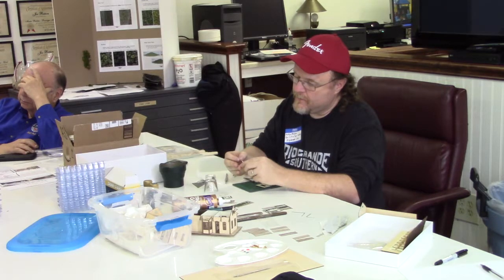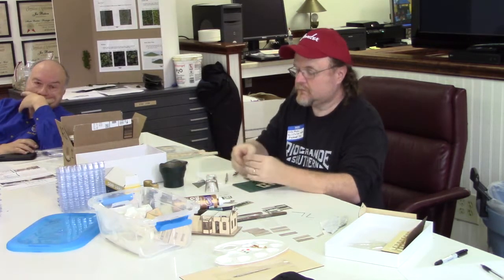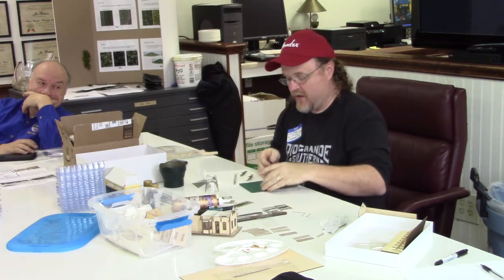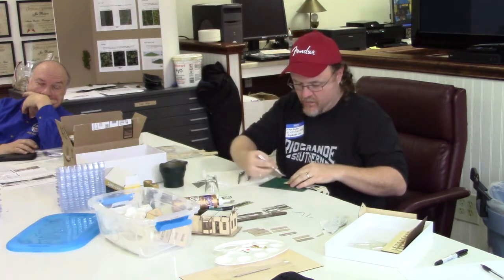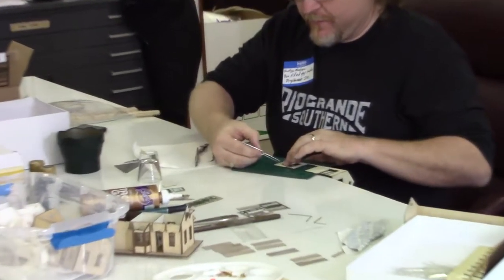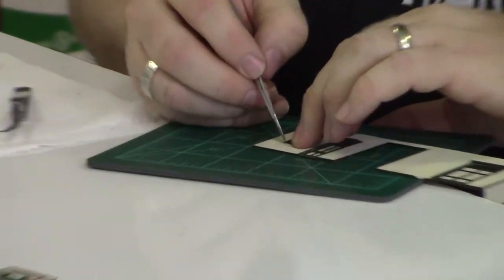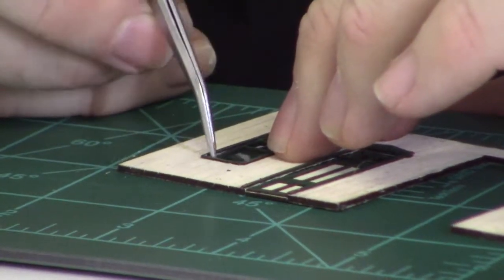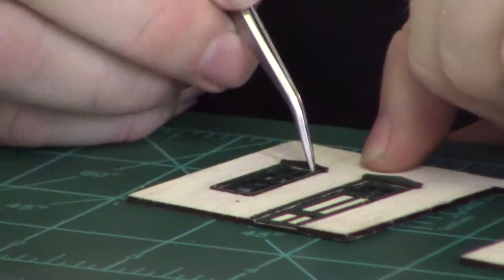Exterior window. Is it flat or is it on end? Well, they both go. The one with the angles goes flat. The one that's the windowsill is going to go on end, because it's actually going to go into the window opening, which is why you want to have that window be recessed just a little bit. That's on the exterior window's trim? Yep. Versus the other one that's not. The one with the double, with the sill.